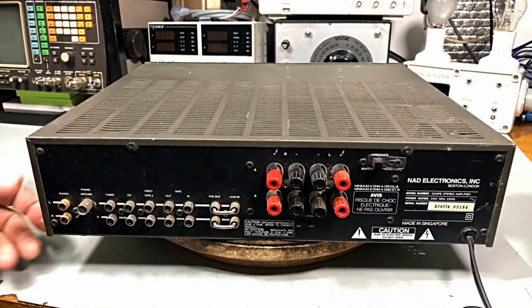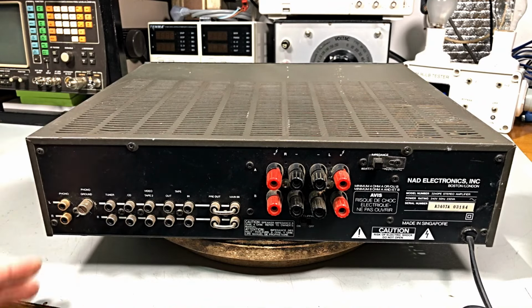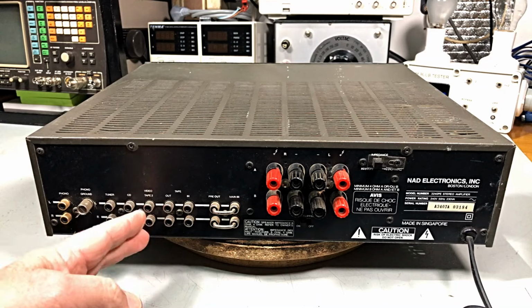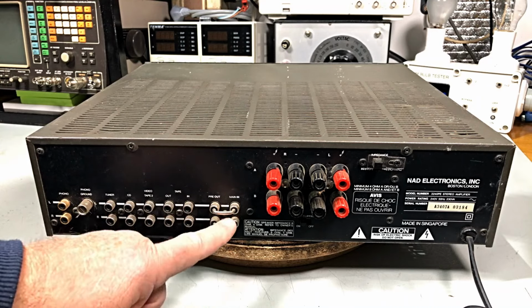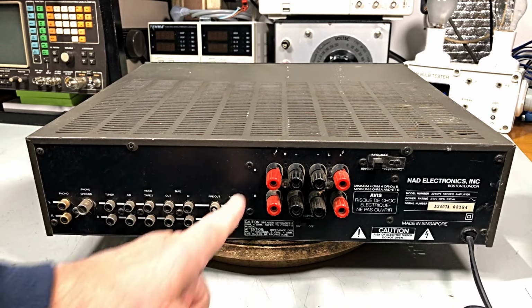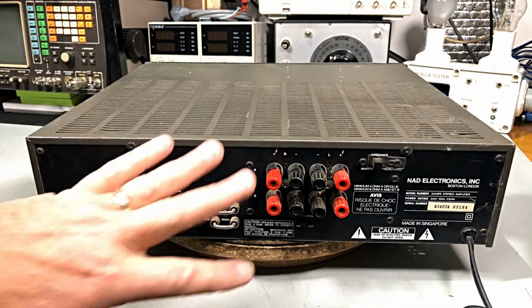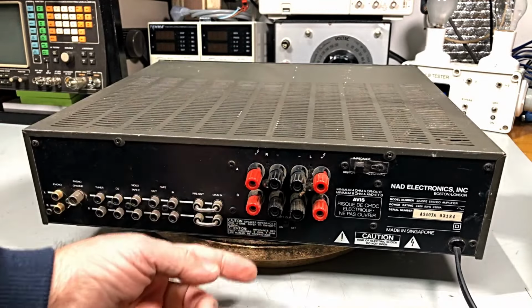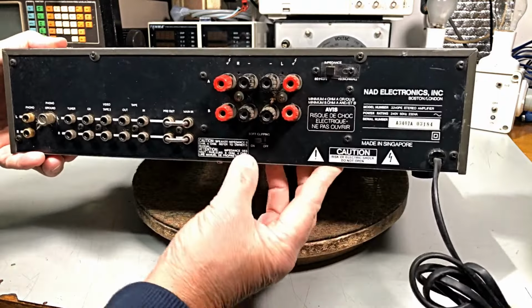what it is. Okay, she's a pretty nice amp. You can't buy them like this anymore. We've got phono, ground, tuner, CD, video or tape 2, and tape 1 in and out. There's also some links here for a graphic equalizer so that you can pull that and go pre-out to main in and do your tone shaping via your EQ that way. Otherwise, you've got bass and treble on the front. Speakers, left and right, and B speakers. Obviously the same speakers, but just left and right.